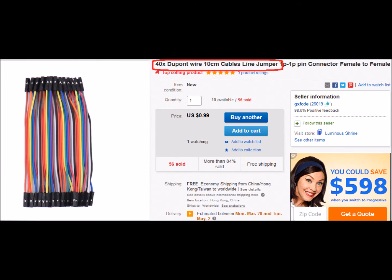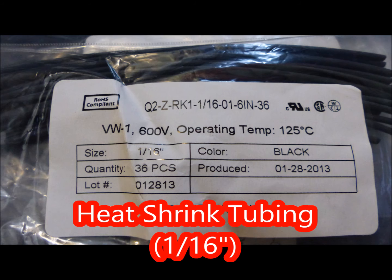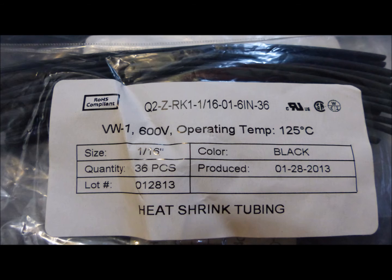These come with 40 wires in the cable and can be found under the title DuPont wires. Make sure you pick the right gender if you're connecting into a connector on the other side. Putting heat shrink over the wires really does help. 1/16 inch heat shrink seems to be about the right size. Heat shrink can add a lot of strain relief to the connection to keep the wire from breaking off at the pin, and it can also keep any stray wires from touching adjacent pins.